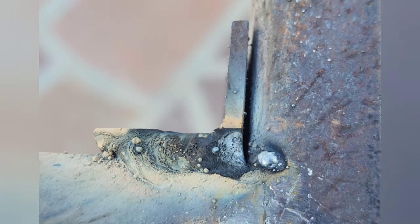I put some caulking around it. This is a double layer of insulation — I put them twice. Make sure you cross them because you can see the joint. I also put insulation in the back and then I put a mesh that I bought from Lowe's, cost me around $14. I just tie it up with wire. Once everything looks nice, I put tile mix that I bought from Floor & Decor — that cost me about six dollars, which is pretty cheap. I put a 50-pound bag, using only one bag, so I put a thinner layer on it and let it dry, then put another thinner layer so it looks even.